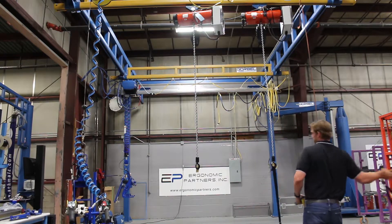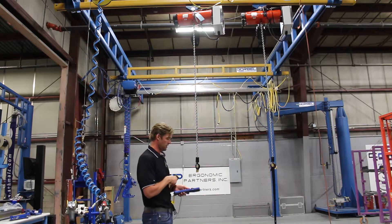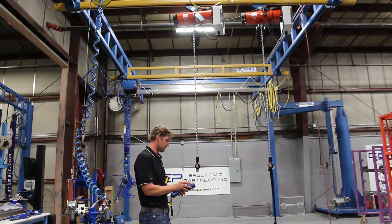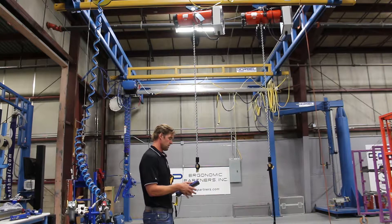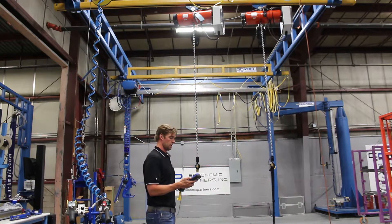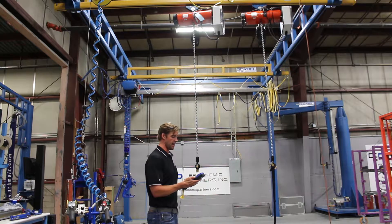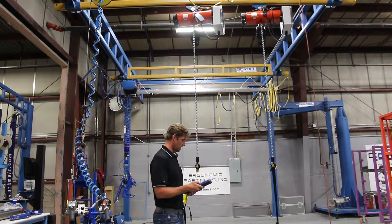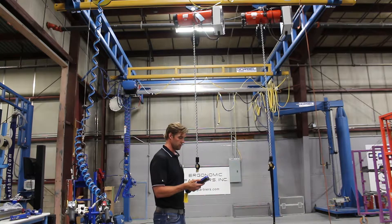I'm going to grab the next transmitter. This transmitter is for this hoist, so I'm going to turn this off and get it re-fired up so I can enter the programming capability of this unit. Holding the start button again gives me the ability to go through and change the access code. On this unit I have a different access code, so I'll scroll through and change it. Then I scroll through to the RF channel — the RF channel on this one is 23 — and change that.